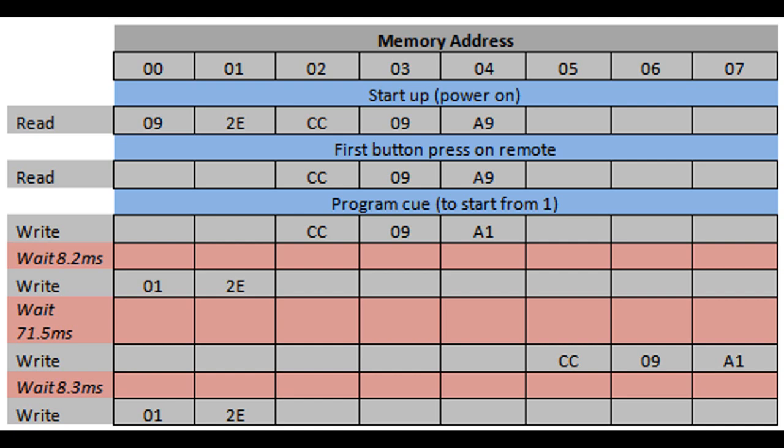There's nothing in the electronics that scares me, and I'm happy to carry on using these modules. It's not horrendously unsafe as some people online suggest. Yes, it lacks a self-checking system like Cobra's, but good practice - like turning the module on without igniters connected first to verify all LEDs illuminate correctly - mitigates the main risks. Safety always comes down to how you do your risk assessment and follow best practice. I'd be more than happy to continue using these after tearing one down.